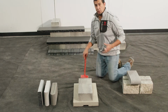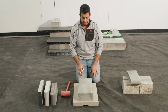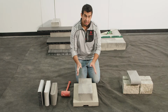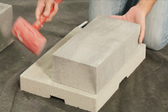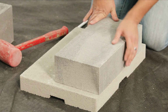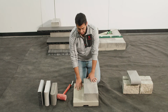Now, with the introduction of our universal base plate, we've moved over to more of a standard build with steps, utilizing that base unit, and that's what you see here. One of the changes that you'll see is we will switch from a middle set, like you see on a traditional wall, to actually sliding this unit to the front, lining up so that our pavers can come flush to that first step. And so now you'll see that I have both support here, front side, and then full support on back side where you have some of that movement happening.